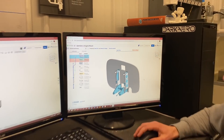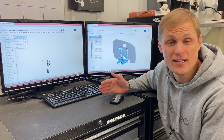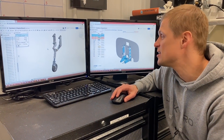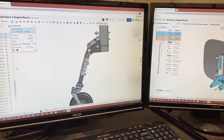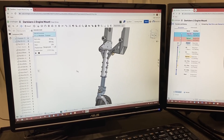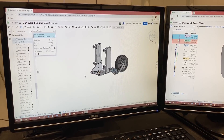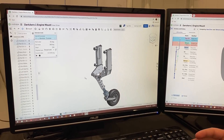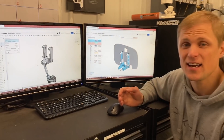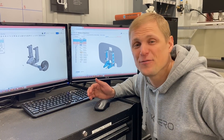Another advantage is that it's going to have faster retract time. So what's the secret? It's gear driven. The issue with our old linear actuator design is that it did not keep a constant mechanical advantage throughout its range of motion. The gear actuation system has a continuous mechanical advantage that remains constant all throughout its range of motion. This animation is somewhat representative of the true speed — we're getting an actuation time that's roughly cut in half. We've already ordered parts and materials to start manufacturing, and we'll cover more details in upcoming videos.